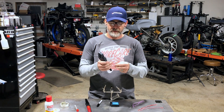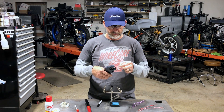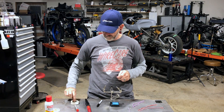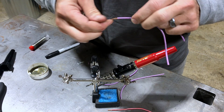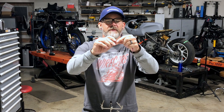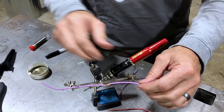First, I'm going to show you two different techniques when taking two smaller wires and soldering them together. I'll take some wire, strip them at the same length, take some flux, and put a little bit on the end of the wire — it helps the solder flow better. Then I'll take that stripped part and bend it in half on both pieces that you're going to solder together. Basically you get two candy canes, link them together, and squeeze them down — they hook onto one another.